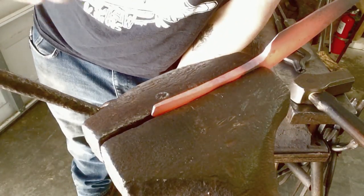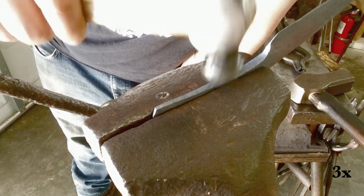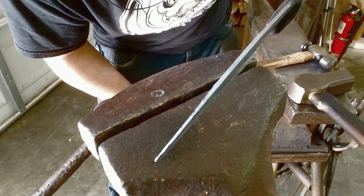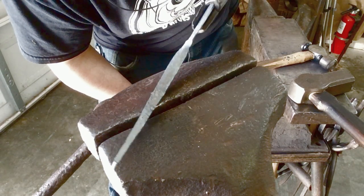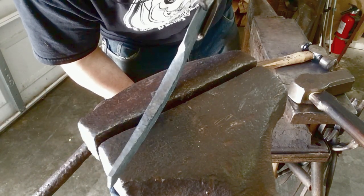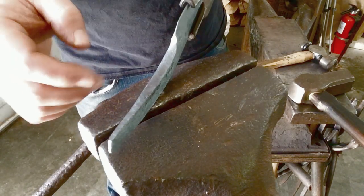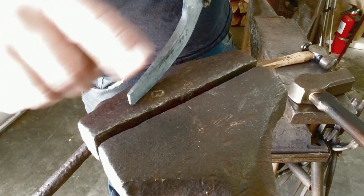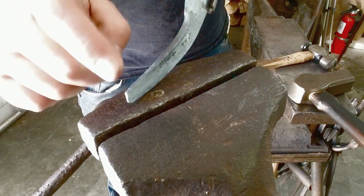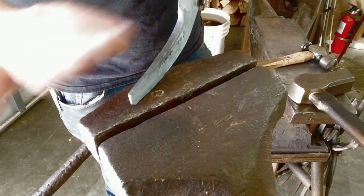Here's a look at the spine — you can see how narrow it is compared to the belly side. That's going to create a lot of nice comfort. It's looking like it's at that nice quarter-inch area, especially up in the first couple fingers, which is where it's most important. Down toward the tip it's not as critical, but I want it to taper nicely down to the tip of the tang. I'm going to keep working that just a little bit more to refine it.